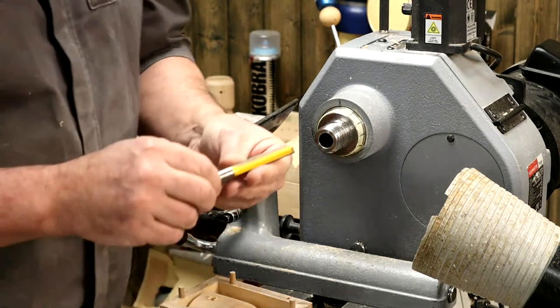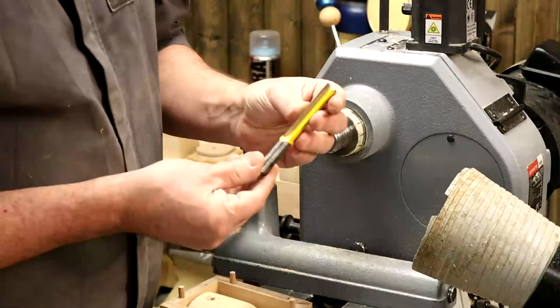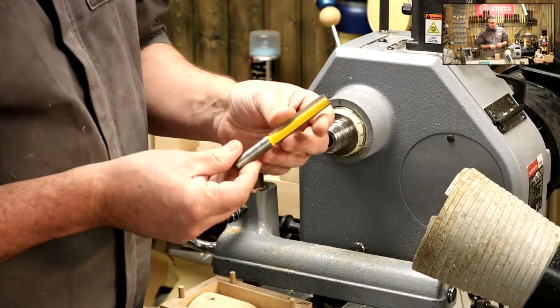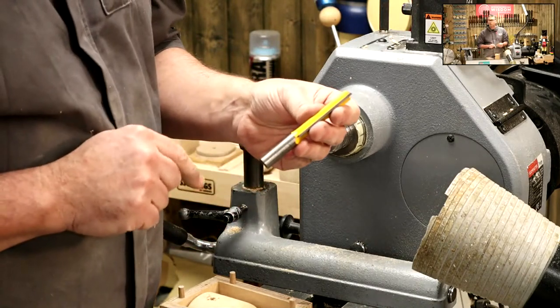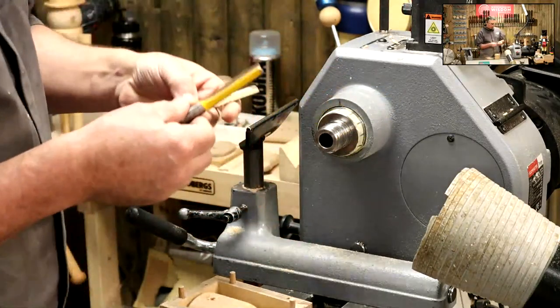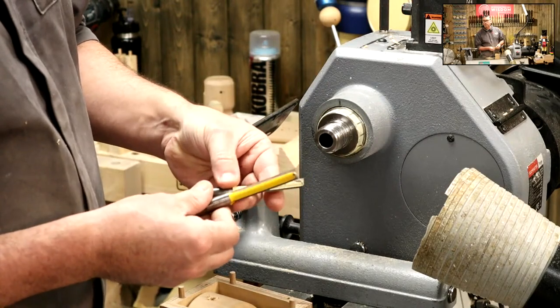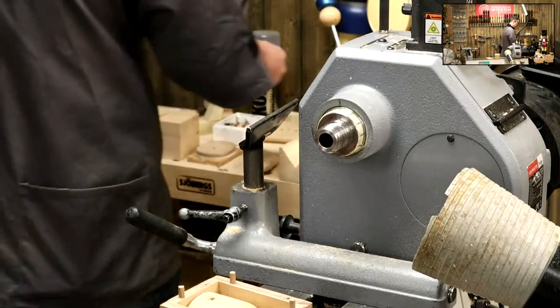And then on a half inch shank, a long kitchen fitter's bit. Kitchen worktop, these will last a long time doing this job. Okay, so I've got two of those. They look battered, but I do sharpen them regularly with a diamond file to keep them going. But you need something of that length to get down that deep, obviously.